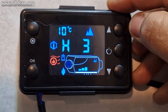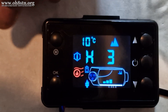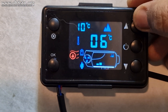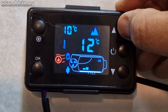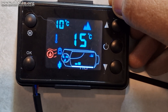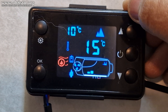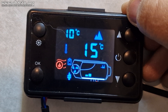The next component in the system is the control panel. The wiring for the control panel goes through the wall along with the ducting to bring the control panel inside the ham shack. Because of the extreme temperatures we sometimes get here in winter, I use the diesel heater in thermostat mode. This means I set a specific temperature inside the ham shack and the diesel heater maintains it automatically. When I'm in the ham shack operating, I will set that temperature at a higher, more comfortable level. When I just want to maintain the batteries, keeping them above freezing, I'll set it just above freezing.